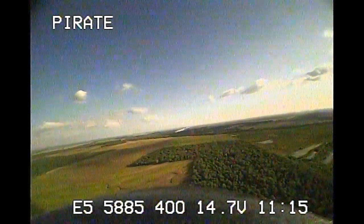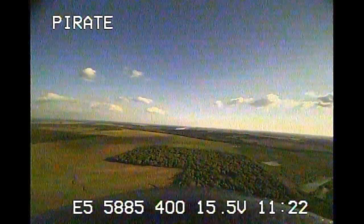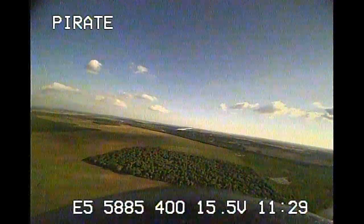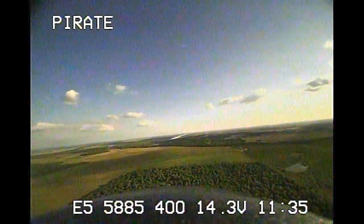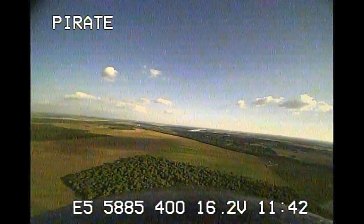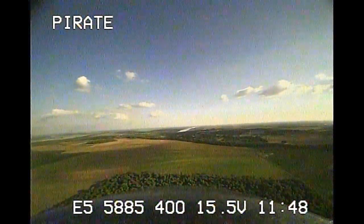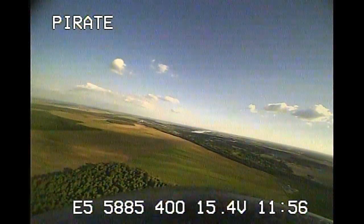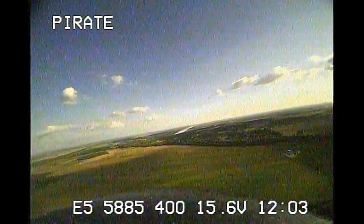Based on what I saw with the Eagle setup, it's going to drop down into the mid to high 60s and stay there. So right now I think the 5.8 GHz video is going to be my limiting factor. I do have my failsafe set up to trigger a return to home using the FrSky failsafe setup. So if we fly out of range, we should enable return to launch and it should fly back. If I do lose video I'll manually switch to return to launch.